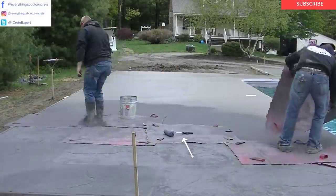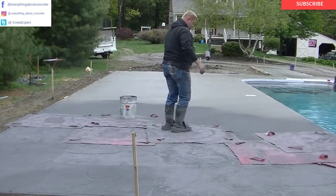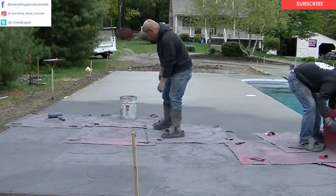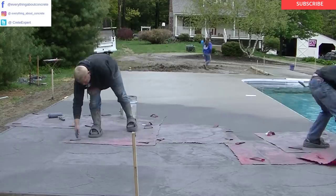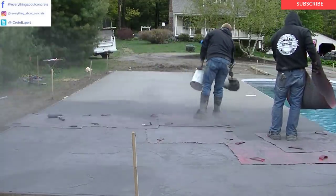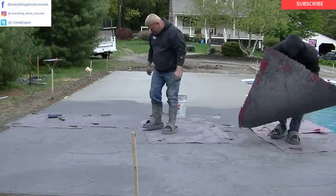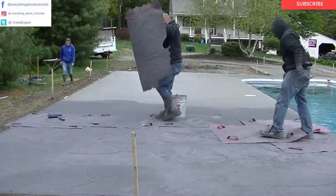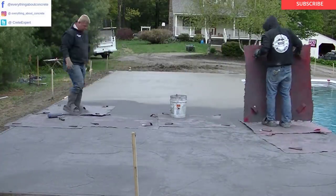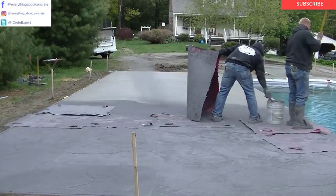You can see we've got a little roller there — a little stone textured roller. We like rolling the edges with that so we don't have to stamp too hard on the edges with our feet. We use the Z pool forms for that inside form around the pool, and that's just held in there by friction. We don't want to be tamping on it too hard with our feet, so we roll it with that stone textured roller. That thing's great. I'll have a link for the stamps and the roller down in the description.